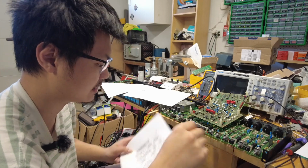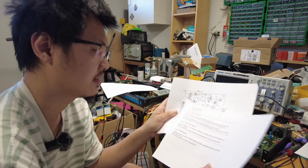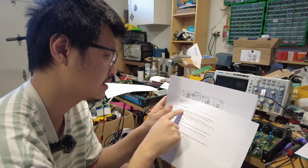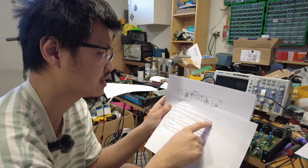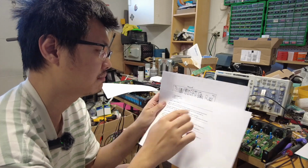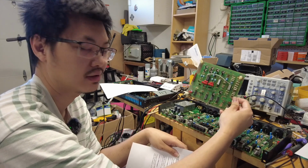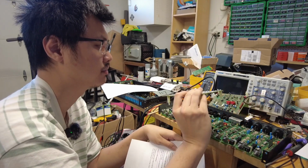The interesting part on the delay card is that I found out, from notes, that in older TC 1210 units some tantalum capacitors turn into perfect short circuits. Well, the unit is powered on, so there's nothing wrong with it. But again, I found that in this particular card there is one short circuit, I think card number 1.